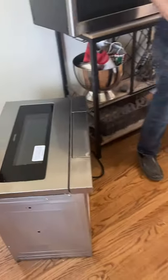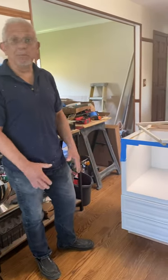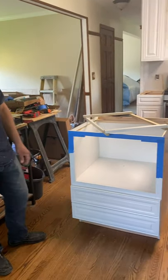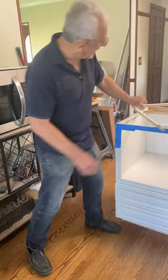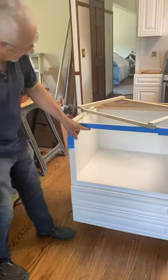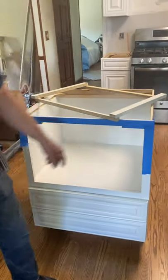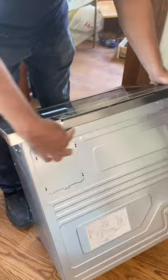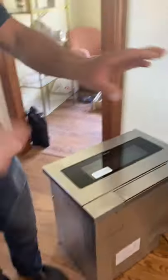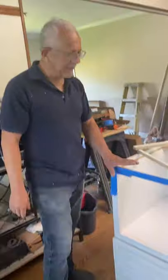We already took the steps to go ahead and do it, just to make sure it works for this video, and I'm happy that everything is going well. The only thing we needed to do, as you can see, is cut a little notch over the top of the cabinet. That little notch allows me to fit this particular piece, which is the highest point of the microwave, and then it goes down to the normal height, which is about 15 inches. That was the only modification needed to convert this cabinet into a built-in.